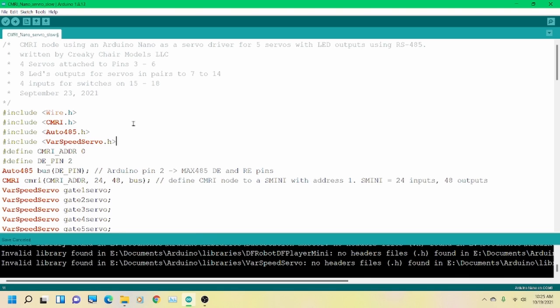Now we'll go through the libraries that we need. We need one called Wire.h that's readily available, as are CMRI.h and Auto485. This one, the variable speed servo library, I will put a link in the description where you can download it. It was found and used by a friend of mine, Ron Kleiss, at Mine Mount Models. He found it just kind of on a whim, and I've seen a couple other ones out there that do the same thing, but this is the most reliable one that I've found.